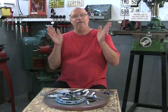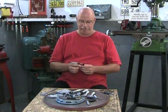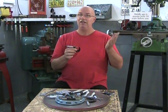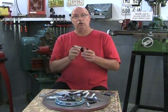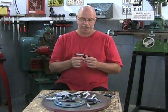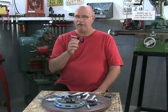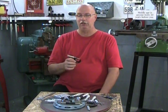Micrometers, however, span a very short distance and are quite limited in their scope — they're really only made to measure one type of thing. If I take my standard zero to one inch micrometer, this is used for measuring outside dimensions only, between zero and one inch. That's all it's made for. It's short, stubby, rigid, and has very little play in it because its movement is quite slow and gradual. That means this tool, if used properly, can be read well within one thousandth of an inch, and with its Vernier scale we can really get down to a couple of ten-thousandths of an inch reliably.